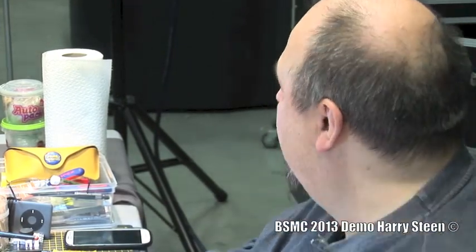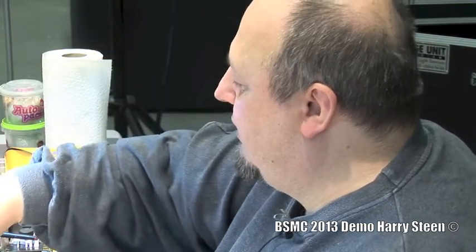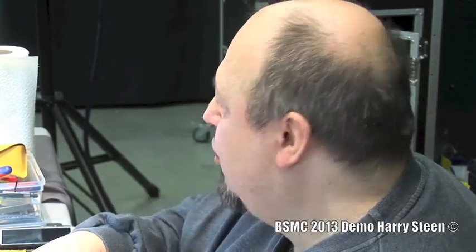How can you do this? Of course you can sand it a little bit — that's one option. But what you normally do is use what is called flux. Flux is basically a liquid that takes the oxidization surface away and makes it clean, so that the solder can adhere to the surface. Another thing it does is make the solder more liquid, so it flows into the crevices and spreads easier, which is very essential because otherwise it's not working.